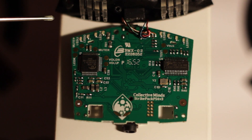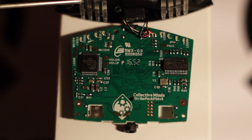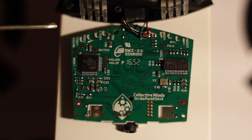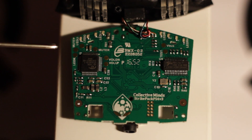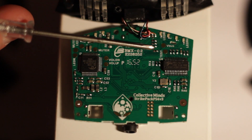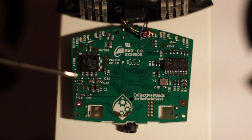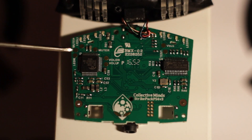The last thing to check out are the LEDs — you can see them along with the light pipes that hook up so they can illuminate out of the case. Other than that, there are some passives and some interestingly labeled test points, including a VBUS test pin — probably a manufacturing test point. There's also a crystal, likely just for the USB hub, and some LC filters on the codec chip, which is pretty standard.